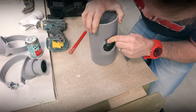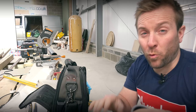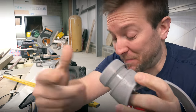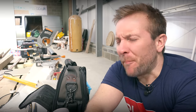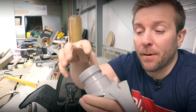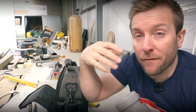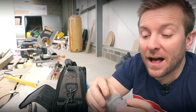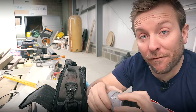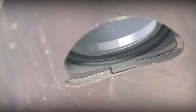Quick thing to look at as well: the collar does have a top and a bottom. If we look, this is the top, and it's denoted by the fact it says — believe it or not — top. There's a tiny little incline going down back into the pipe, and that's totally normal. These are actually two different parts — the strap boss is the same for everything, but you can buy an inch and a half or inch and a quarter insert socket to go in there. There's also a little notch — make sure when you put this in, you've got top there and top there, and that they meet up together. You'll see that our lugs are sitting perfectly inside that pipe now — that's exactly what we want.